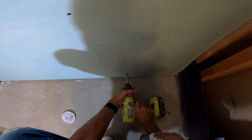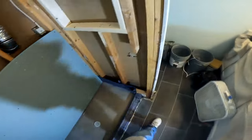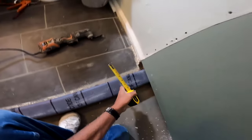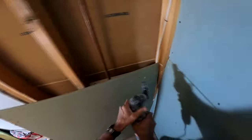Having been in the apartment business for many years back in the early to mid-90s, when tile starts falling off the wall is when we get a work order. The tiles fall off because you have the shower valves — two-handled, hot and cold — with packing that goes bad and sprays behind the wall into the wallboard, ruining the sheetrock. Then you have builder's grade 4x4 tile with unsanded grout. That's the reason why walls fail with gypsum in a wet area, in a tub.